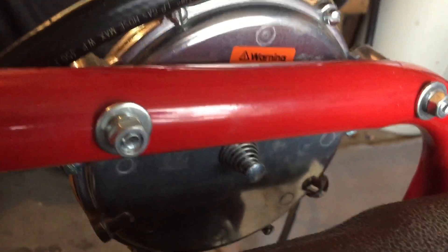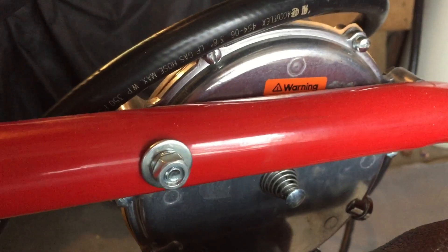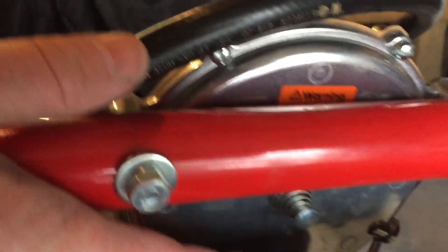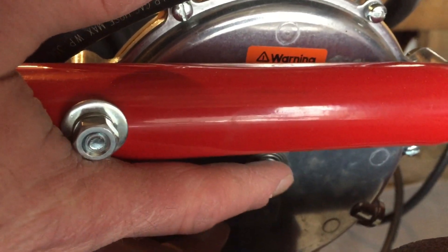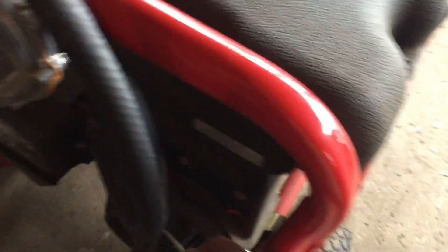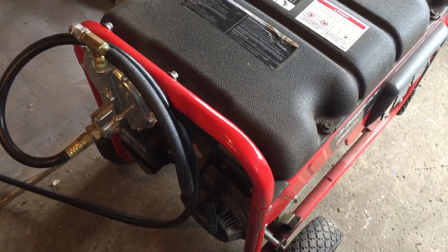You can see down there on that disc there's a little spring button — that's the priming plunger. You hit that a couple of times and it puts fuel directly into the cylinder. I'll show you how that works so you can hear the propane. Then all you do is give the recoil pull. As you can see, it starts very easy — two pulls and I had it going.